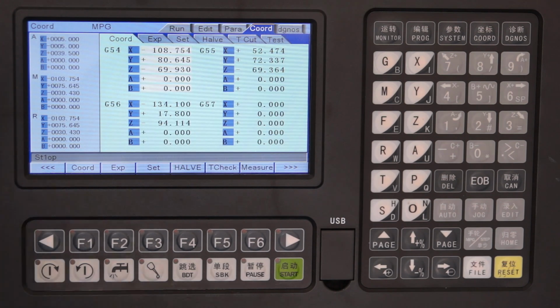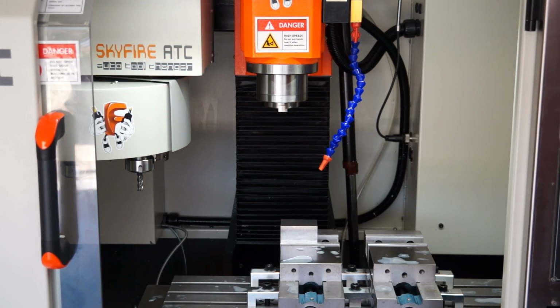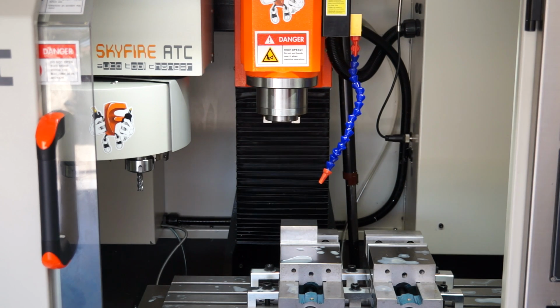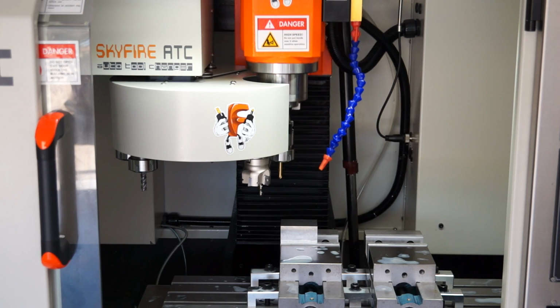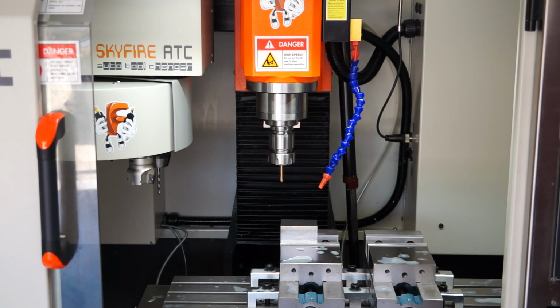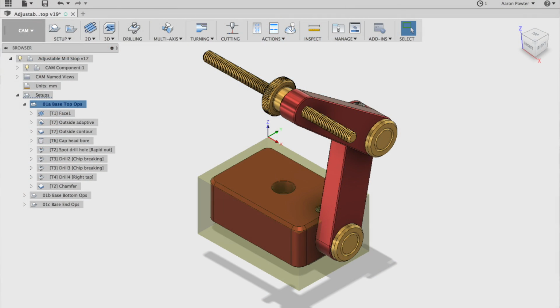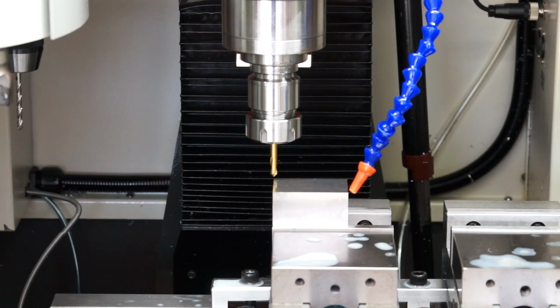What you're seeing here now, guys, I need to set up the work offset, okay? This will be G54. Usually with my left hand vise, I always run the G54 work offset. And here I'm setting up the Cartesian coordinates, so I'm setting up the X, the Y, and the Z. Now you'll notice I'll pause for a minute. I'm doing this with my probe because I'm going back to the controller and switching between MPG mode and MDI mode to save those values in the controller.